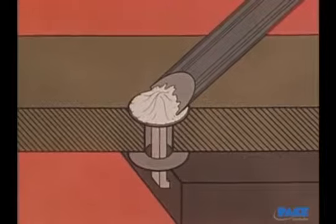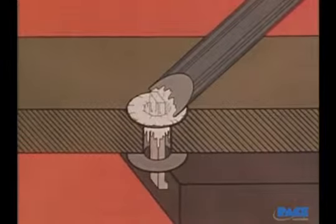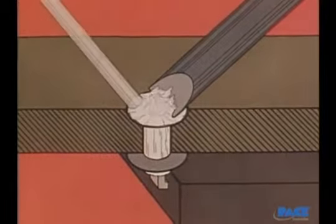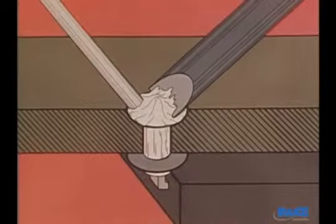When you continue to hold the iron there, you'll see that the solder pool drops all of a sudden, as it flows through the hole and wets the pad and lead on the opposite side. Then you need to add a little more solder to mound it up on top.